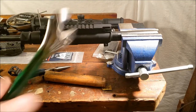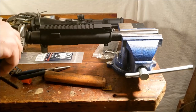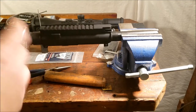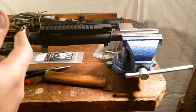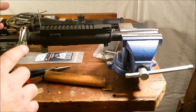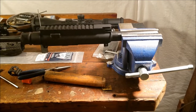All right, so notice I did not lube up this barrel nut. I simply threw it on there. Dissimilar metals. Obviously, one's going to hang on the other one pretty good. Again, like 55, 60 foot-pounds. I know the specs are all over the map. They say anywhere between 35 to 55 or 65 to 75. I just tend to go about 50, 60, and I have yet to have an issue. I've never had a situation where I couldn't bust apart an upper receiver after I was done wrenching on it. And it never, ever comes loose. Everything is completely on there the way it should be. So let's move out smartly.